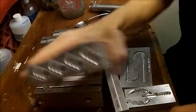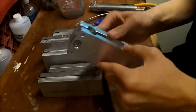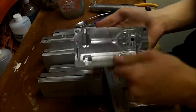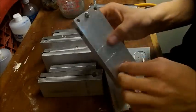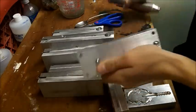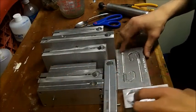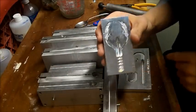That's one configuration — vertical pour. The next configuration is a side pour. This is the new summer chrome mold. As you can see, it clamps up — you can clamp it with bar clamps or use screws. I don't really use the screws, I use the bar clamps — and then it injects from right there.